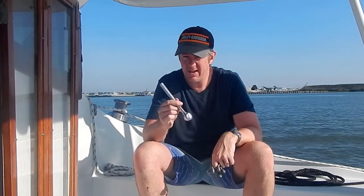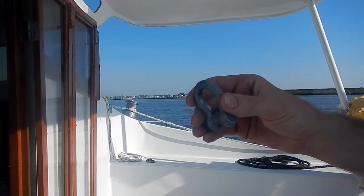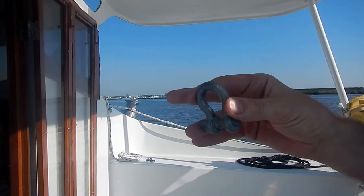As you know, I don't have a lot of tools on this boat — I should have more. I just grabbed a handful of screwdrivers, pliers, little things I thought I might need. One thing I don't have is a rasp, but what I do have is a ratchet with a nice knurled end on it. I'm using it to booger out the inside of these shackles just a little bit. In their current size and shape, they almost fit over the ends of the stainless steel tubes on the rudder cassettes — almost. So if I just take away a little bit of material, they should slide right on.